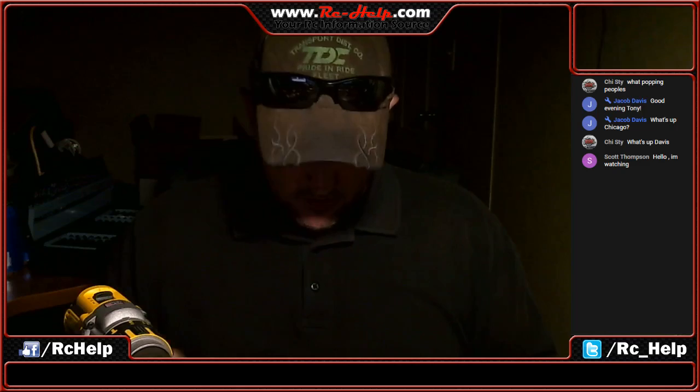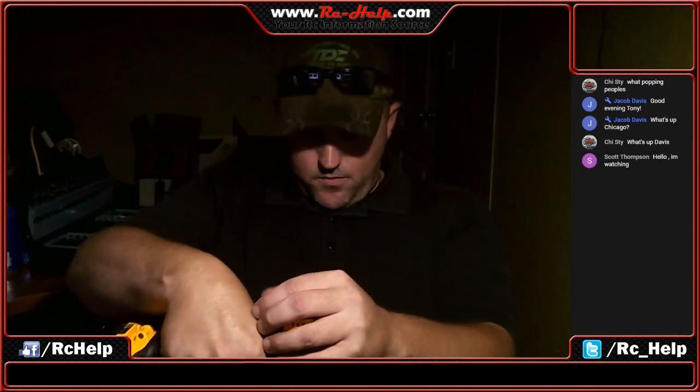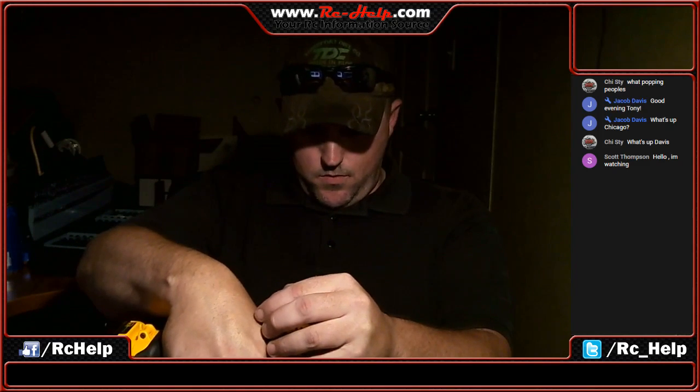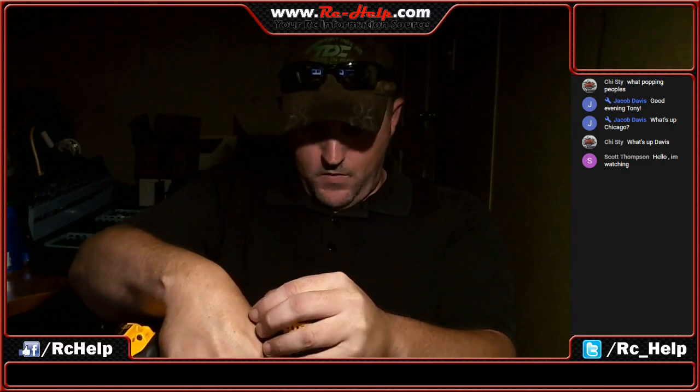If you have a center punch, use a center punch. For me, I'm just gonna lay it down, put my drill bit on the mark, and just get her started. That way I can bring it up here and you guys can see what I'm doing.